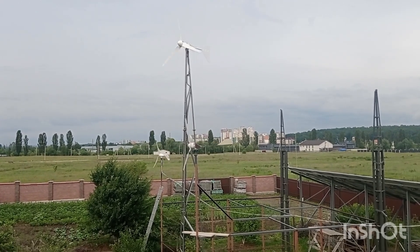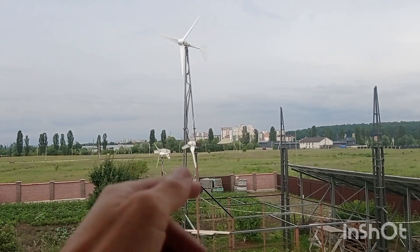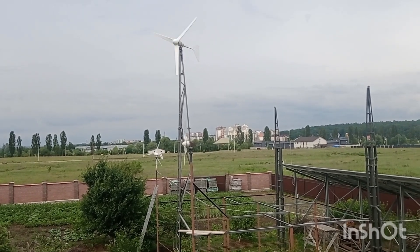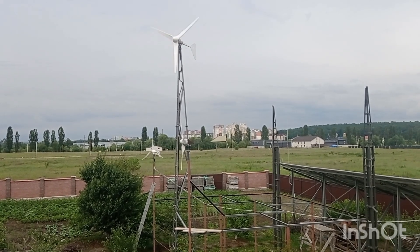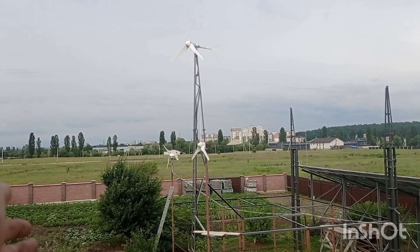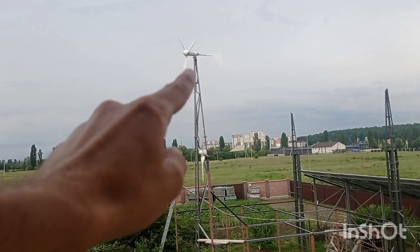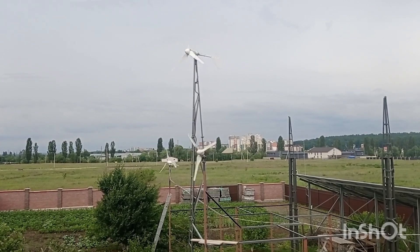You can see the wind has died. Since the wind wheel has a lot of gyro effect, it keeps rotating, but the tail is good enough in length but probably not in area, so I will think about adding a different plate to give it more stability on slower winds and turbulence. The S3 at this kind of wind showed a maximum of 4 watts today; this self-made one was able to show somewhere around 70 to just under 80 watts at peaks.